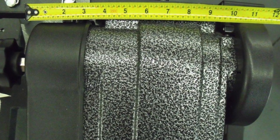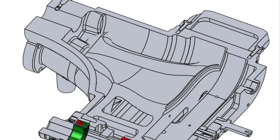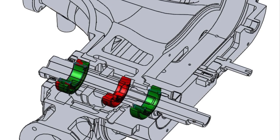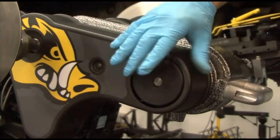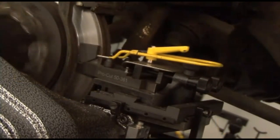We realized that we had to increase the distance between the two main spindle support bearings. By taking the bevel gearbox portion off of the main spindle and putting it as a separate unit, it allowed us flexibility in the spacing of those two main tapered roller bearings. So the stiffness of the belt lathe is a good deal higher than on the nine series lathe.